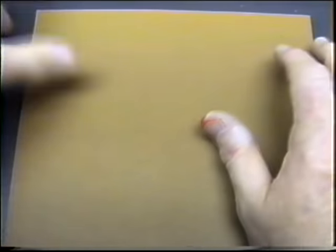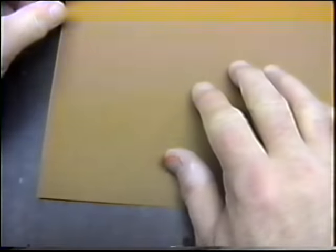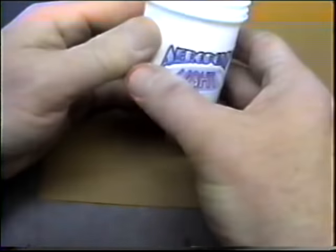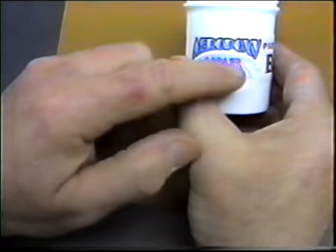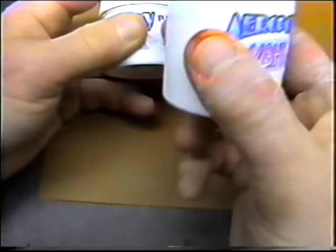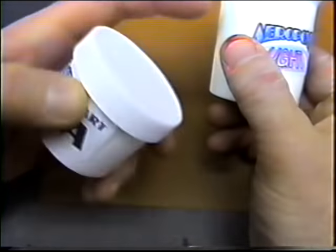Before I do anything, I want to get a piece of cardboard. Now, what I'll do is go to the gram scale, weigh the cardboard, then weigh up how many grams it is, write it down. Mix twice the amount by weight. Again, it's not by volume, it's by weight. So one amount, two amounts, doesn't matter. If this is 7, make this 14.